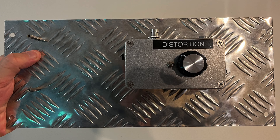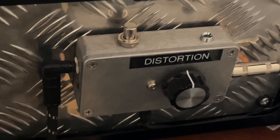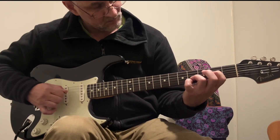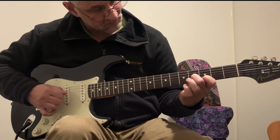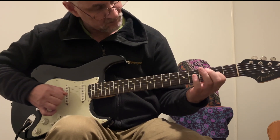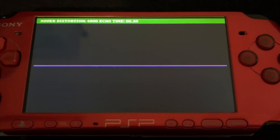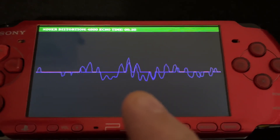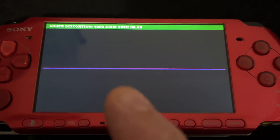First things first, I can finally demonstrate the physical distortion pedal, which was the topic of the last two videos, with something smooth. Crossover distortion is relevant because it's one of the effects that I've implemented digitally. It isn't that the tops and bottoms of the wave are clipped — the distortion is actually present at the zero crossing. Everything that is below a threshold amplitude, either on the positive or negative side, is simply zeroed out.